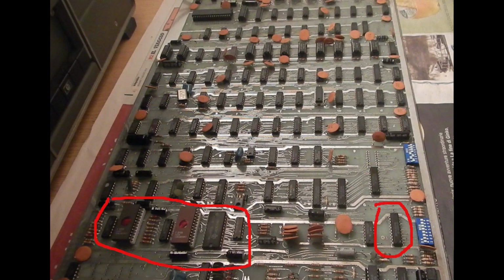However, this clone lacks the custom Atari Pokey integrated circuit that's used in the original PCB to generate the game sounds and to read some of the configuration dip switches. In this bootleg, the sound generation part has been substituted by two EEPROMs that contain 4-bit digital samples of the sounds that are played back by addressing and scanning these EEPROMs with TTL counters and a few other glue logic ICs. The dip switches are read by using a common 74LS244 buffer IC.